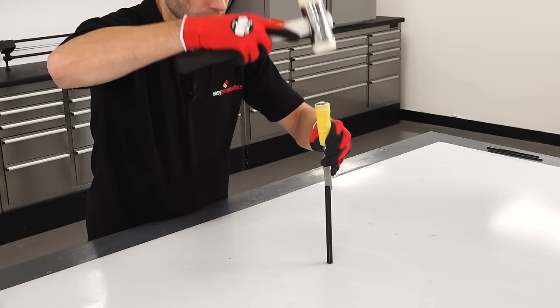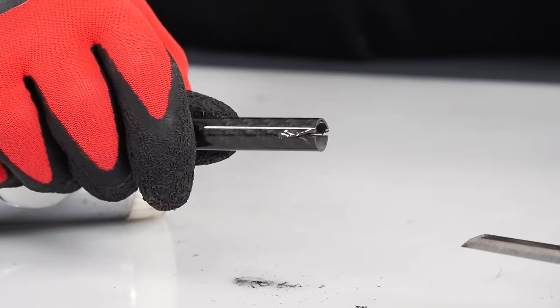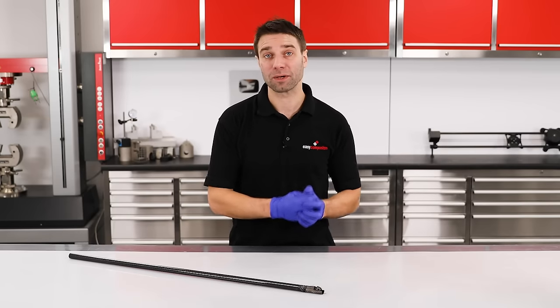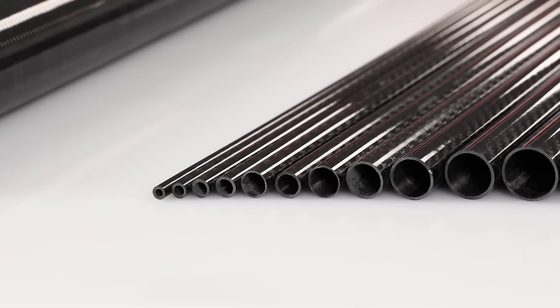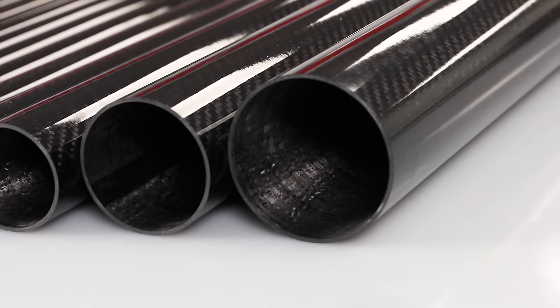With a typical laminate stack like this, these tubes do sacrifice some of their longitudinal strength and stiffness for hoop strength. By doing this it makes them much less prone to crushing and splitting, as you can see it's able to withstand the splitting force much better than the Pultrusion did. They're also slightly better at taking torsional loads and are generally more robust for most applications. This manufacturing process suits larger diameters, starting at around 6mm and running through to 60mm and beyond.